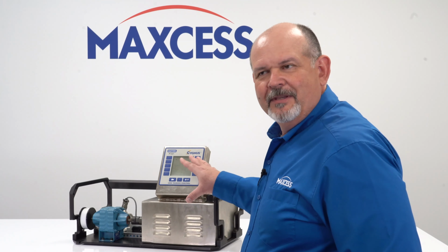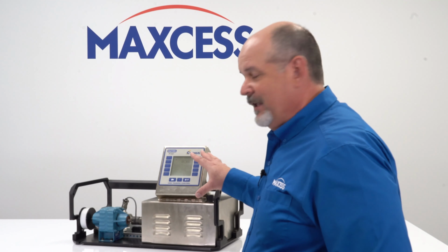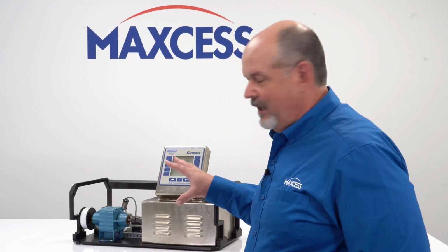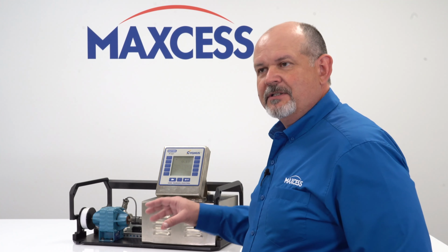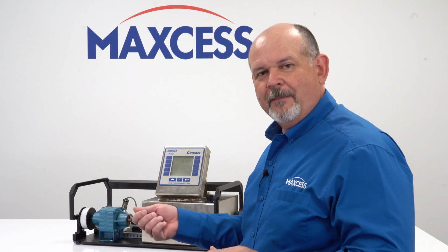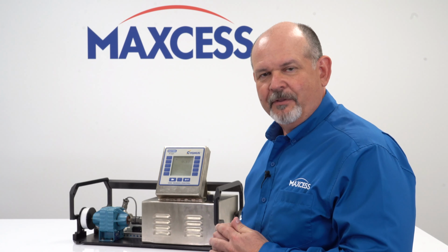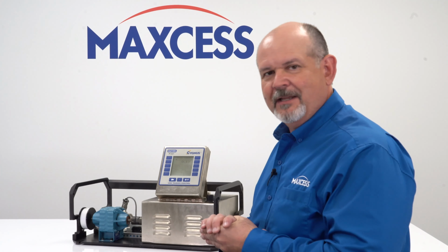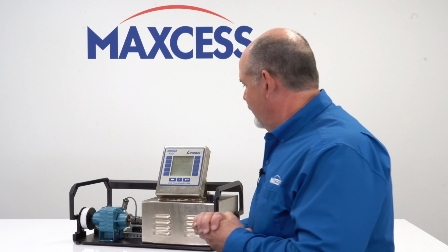Today we're talking about the Cygnus Tension Controller. We're going to go over the unique ability of this control to do weightless load cell calibration. In a traditional load cell system, you would have to thread a rope or a strap through the system and hang a known weight to calibrate the load cells. That is not necessary with the Cygnus control, so it's a huge time-saving factor.